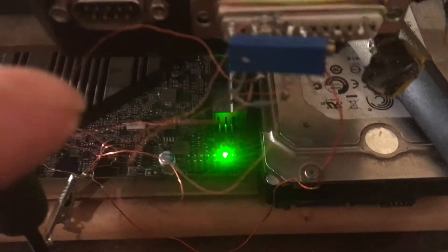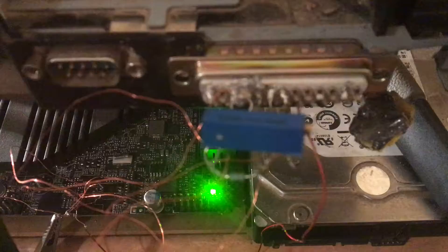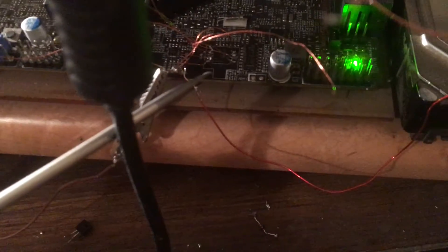Alright, so this is how it's done. I got the parallel port here hooked up. Now I had to drop the voltage because the voltage was too high on the input pin from the chip. There's the BIOS chip. I wired it up with magnet wire and that was the easiest.